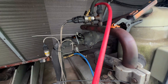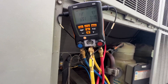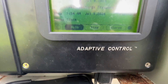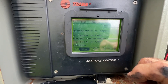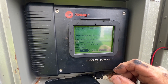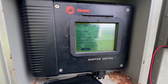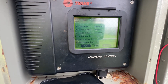Had to break my probe on there to fit on the suction line. All right — spoke too soon. It just shut down to alarm again, discharge pressure transducer. So we're probably going to be replacing a cable.